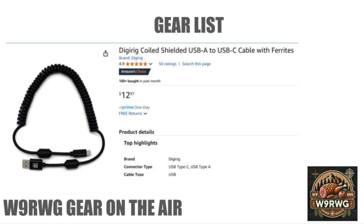If you're experiencing radio frequency interference, RFI, on your computer, you may notice issues such as difficulty using a touchpad mouse when the radio is transmitting, or rig control errors with the software. To reduce interference, consider using a shielded USB cable with ferrite cores like the one demonstrated in this video.